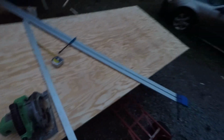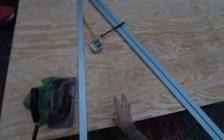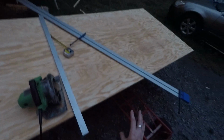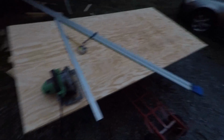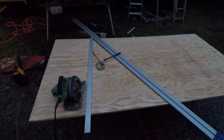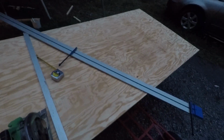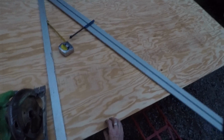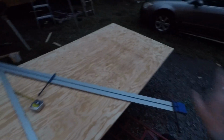All right, now it's time to cut the subfloor and install it. For subfloor we chose plywood that's pine, 3/4 inch thick. I didn't want to do the Advantech OSB because I have bad experience with it. The previous owner had put it in the bus, but the bus had leaky windows, so some water got on the OSB and all the edges were swollen, warped. It was horrible and I had to throw it out.